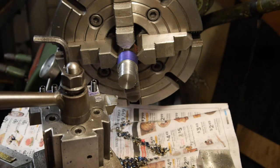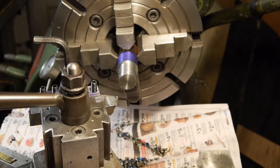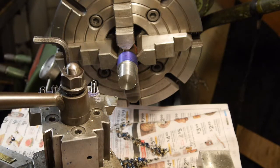Let's not say experiment failed, but to be continued. And I got another cut. I gotta take another 200 thou off. Let's give her a look-see. All right, it's almost exactly 200 thou. Now, that'll get me to finish depth, and I'm just about positive that I cannot get a nice finish on a hog cut like this. I mean, I probably could, I just don't know how.